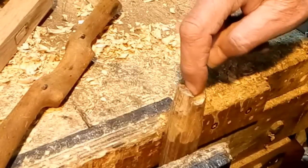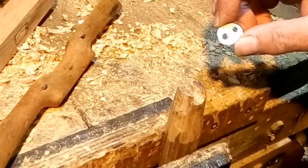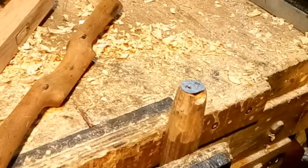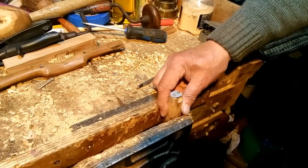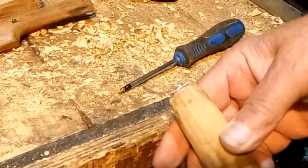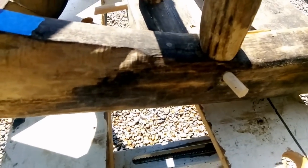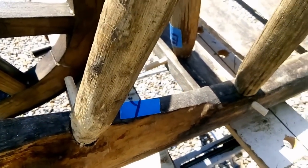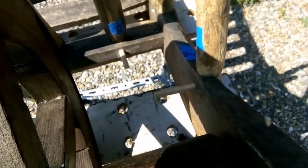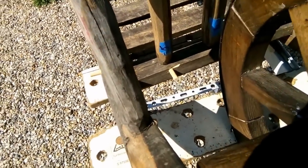One of the uprights had a similar problem to the tenons with a broken dowel hole, so I made it a little tiny metal cap so that the rod wouldn't pull out when the dowel was put in. So now I've cleaned and doweled the bottom end of the uprights into the framework, but now I need to fit the new rail onto the top end.